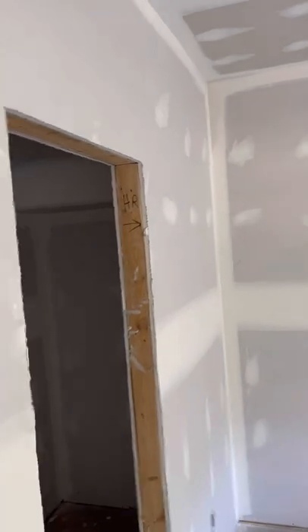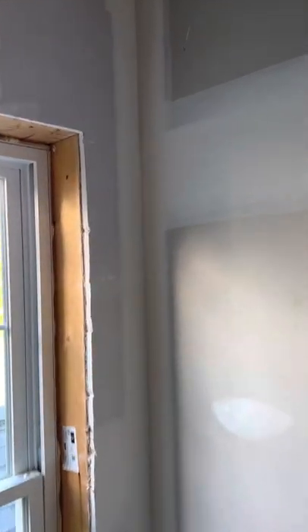But when our houses are finished, if you use the system that I'm explaining, you'll have minimal touch-ups. There's going to be a couple — this is a big house. But you'll have minimal work: run the box, wipe it down, go through, make sure everything's hit. Make sure your three ways are picked real nice, make sure they're clean. It makes it really easy to sand if you've got that three-way looking nice up there.